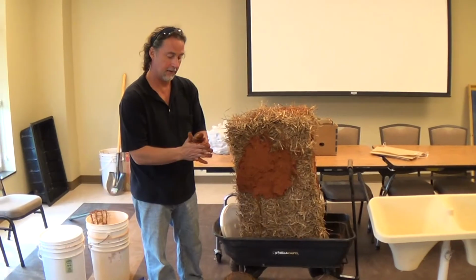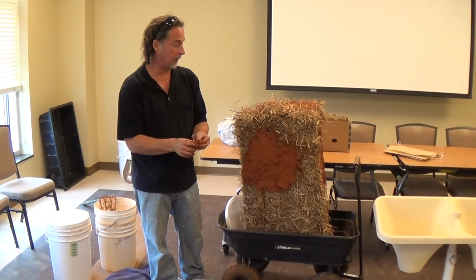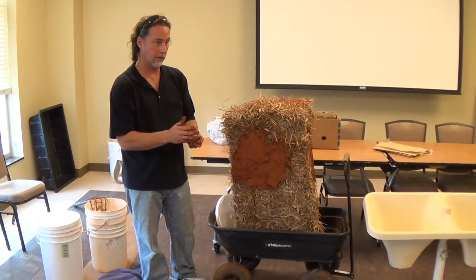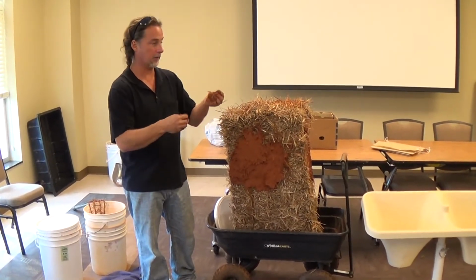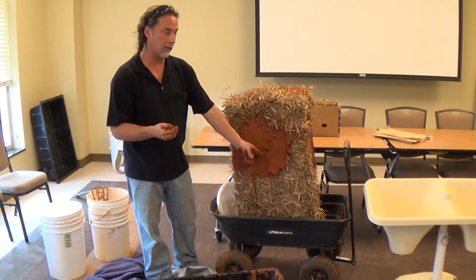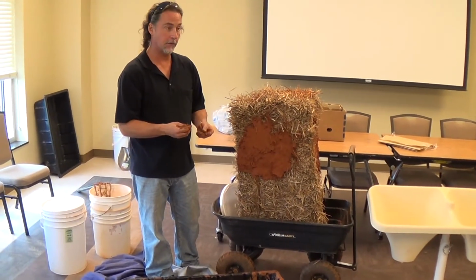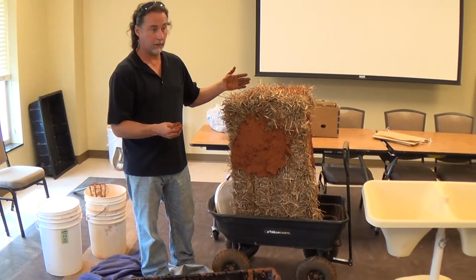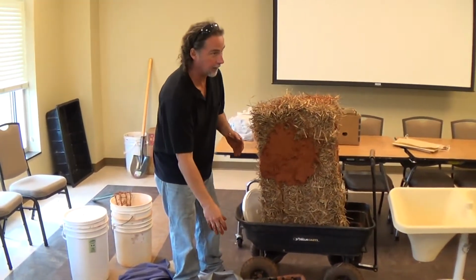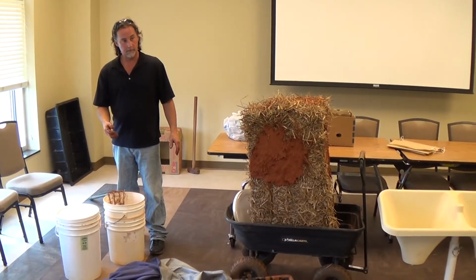Well, actually, you would think, oh, straw bales burn easy, but if you do a little research on them and compare to a normal house, they won't smolder. I mean, it'll catch the paper on the sheetrock and burn the paint and all that. Actually, if you put a direct flame on a straw bale, it will smolder for 2 hours before it ever catches on fire. And that's a proven fact. It is rated so much better for fire than what we build with now. You've seen them where they stack them in a barn and it'll catch on fire in the middle from the heat?